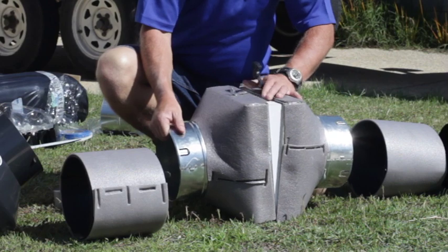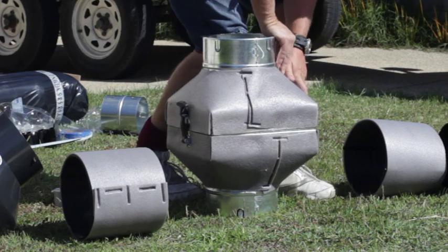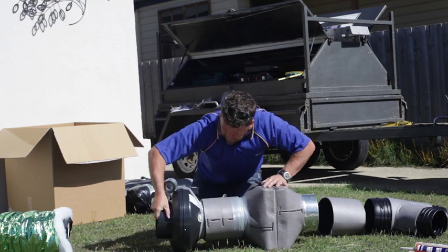The next stage is to prepare the air handling kit items at ground level. First of all, insert the filter inside the filter housing, and then connect the filter housing to the fan and the inlet duct to the fan inlet.